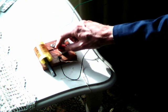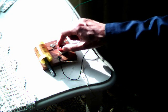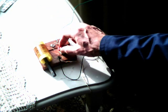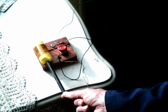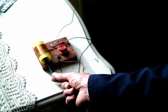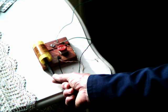You can tune in other stations with it. You can tune the radio by either turning the tuning control or by moving the ferrite rod. If you take the ferrite rod out completely, you're really onto the short wave band, and as you move it in, the medium wave station comes in. And considering it's only a very simple crystal radio, the quality is actually quite good.